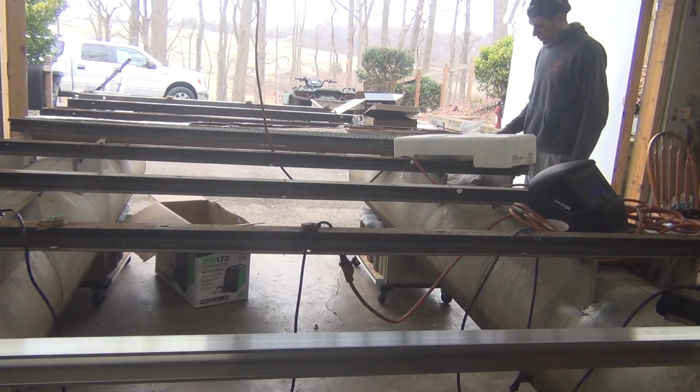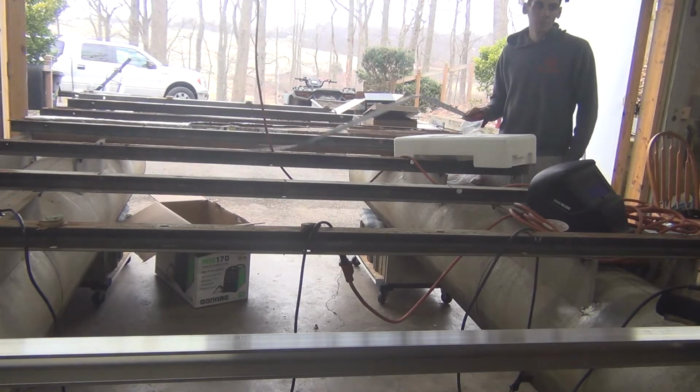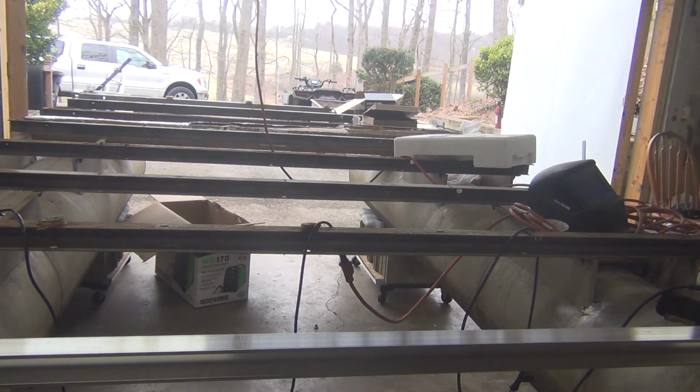They're actually just under. Yeah, we're going to have a problem. We're going to have to eyeball this bolt. We're going to have to drill this separate, which is going to kind of suck, because we're going to have to measure it, drill it, and measure it, drill it. Measure in and down and get the hole right. Actually, we've got to do it on all three. So we're going to have to drill these holes in this first.